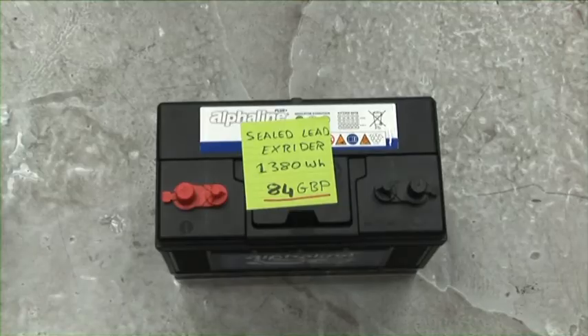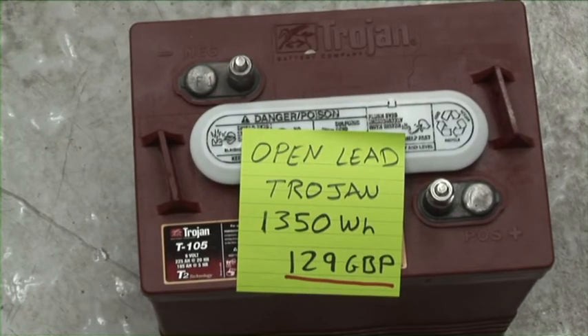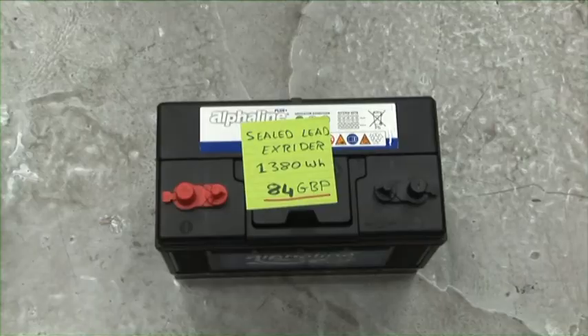The reality is this battery is £84 and this battery is £129. If you are a leisure boat user - which is two weekends per month plus maybe three to four weeks holiday in the summer - then you will easily get five to six years use out of the leisure battery. However, if you're going to live on board and use your batteries every day, or if you're going on long-term cruising, I would suspect that battery would last you in the region of six months.